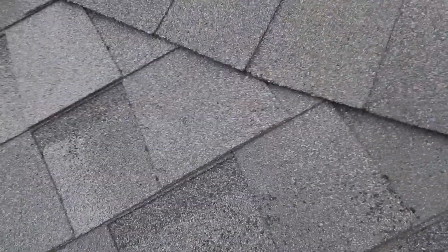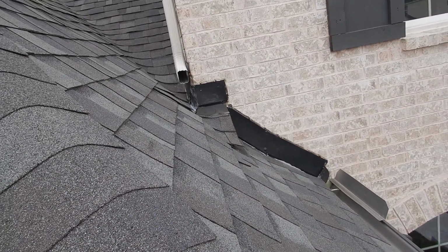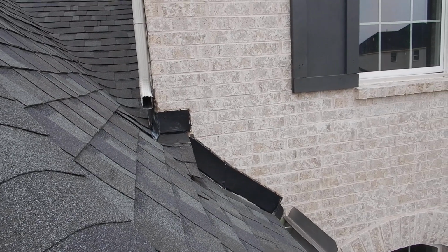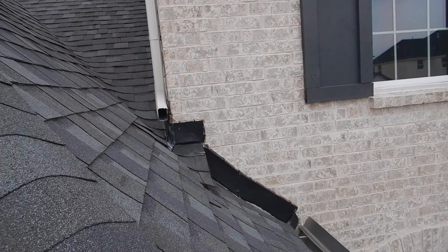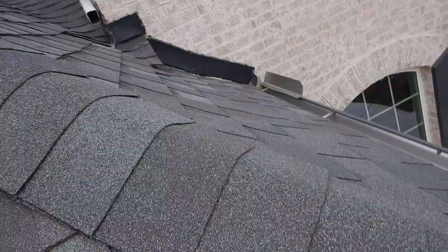And see the way they've added, they've extended. See where they've added onto this? They've been wrestling with this point. And all this sealant, all that pooky around there, okay, it needs to be checked every year or so because it shrinks, it dries, it pulls away from the brickwork. So this is a heavy maintenance area.